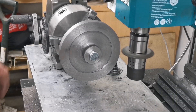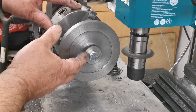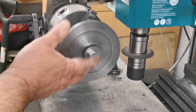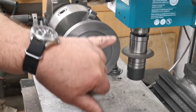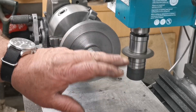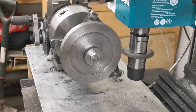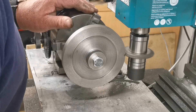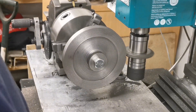Right, so I'm just going to cut the teeth on this blank again. Everything I have checked three times, it's all done up tight. I'm going to cut to halfway through at 105 and then the final distance. Nice and steady, let the cutter do the work. Right, that's the first one done.